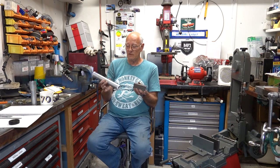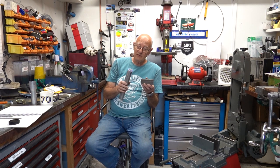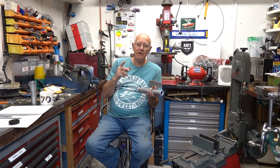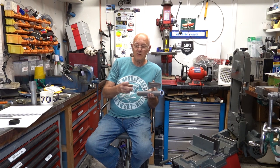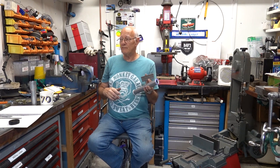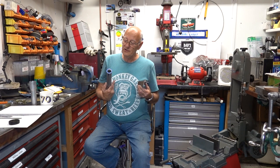This is a piece of exhaust tube. It's on a thin wall because it's exhaust tube, it's steel. I've made two nylon Delrin bushes that accept the aerial. Now the aerial is in two sections, a tip. The top of it is a small fishing rod, I guess, a Shakespeare, which will have obviously the conductor up the centre to make it resonant at 10 or 11 metres. The base is quite a big, chunky, 1-inch diameter fishing rod, which you see the likes of on big boats, fishing boats and things, that go out to the bay and do the fishing trips.